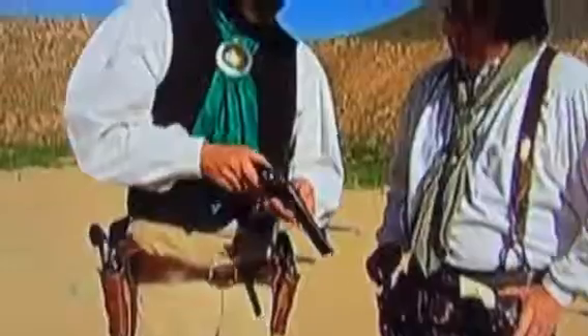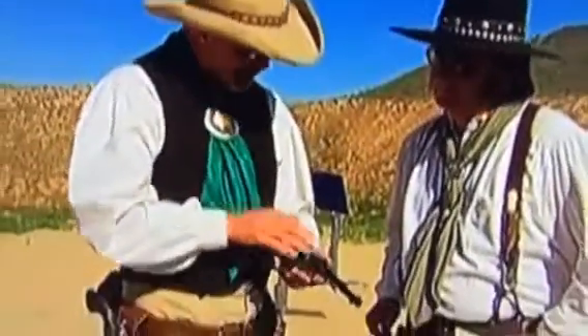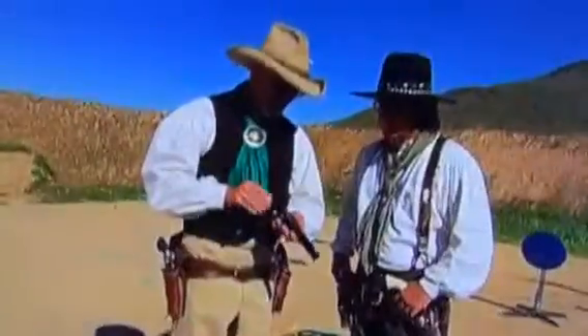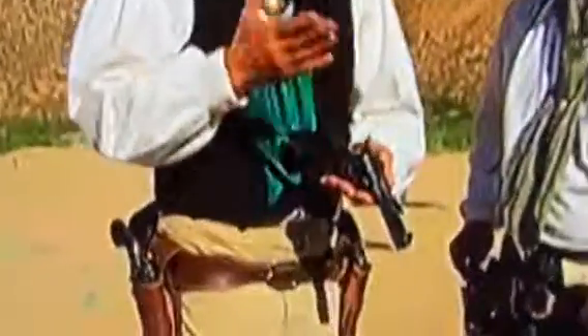So that's one thing that we do. Another thing we do in these particular guns: Colt and USFA still stay with the standard handspring that was designed in 1873 for authenticity. So what we do is go in behind the frame, drill it, and install a coil plunger — which is what Bill Ruger figured out back in the 50s. And that takes care of that. Lasts forever.